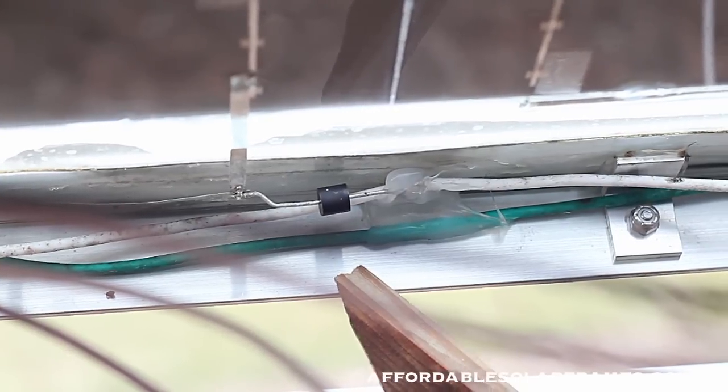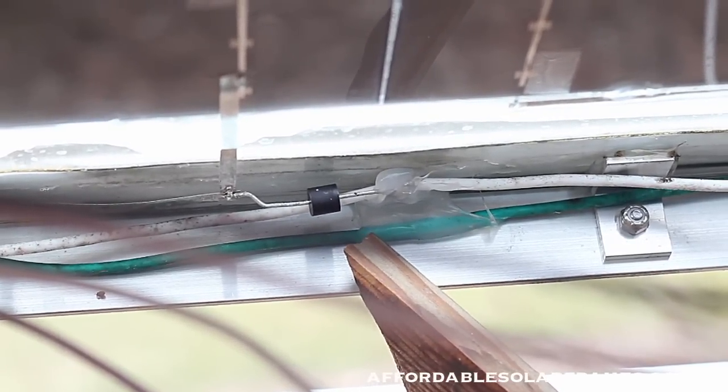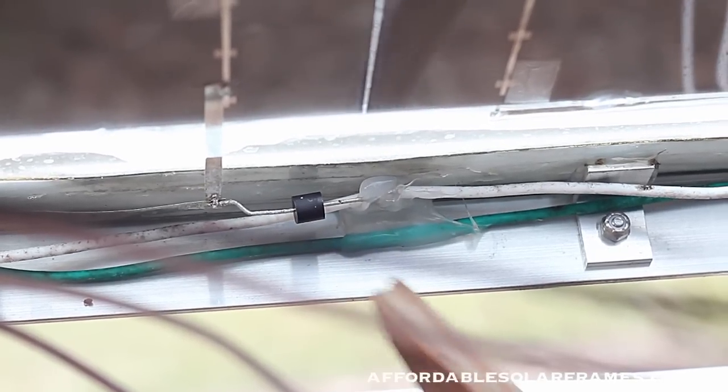Hey, I'm Mark and we're on the back side of my solar array. I'm going to show you how to split this up and then we're going to walk up to the batteries. I'll tell you how to pick the batteries and the inverter. This is a 108-cell panel. Each 36 cells has its own diode and wired separately, and then all of those wires come to a terminal block.